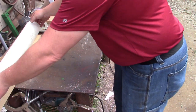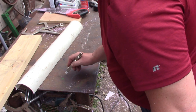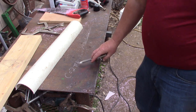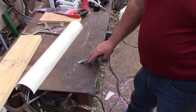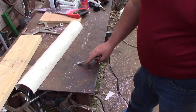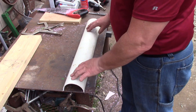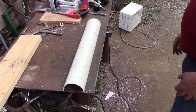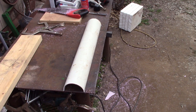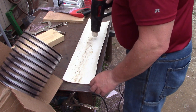I took the inside diameter of my hose - the formula for figuring the circumference is C equals two pi R. R equals four because I've got an eight inch pipe, then you multiply that times pi - I forget what it is exactly - but you multiply that by two and I got 25.125. So I cut this 25.125 inches long. Now all I've got to do is heat it up and flatten it out. I may have to make a form on the lathe - I don't know if this is going to work or not.